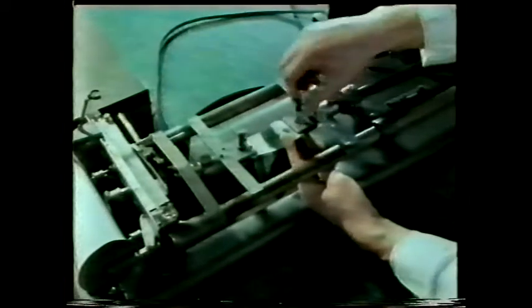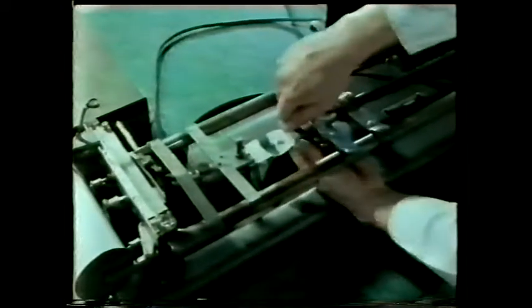Let's see what happens when we try pulling two similar pieces of fabric apart after the bond has had time to develop. We're doing this in a tensometer. Here we're peeling the two pieces apart. The fabric we've chosen is stronger than the dried adhesive - see how the adhesive is being stretched and torn? The bond is produced by the adhesive wrapping itself round the fibres of the fabric. The adhesive interlocks with the fibres, forming a mechanical key. This is called mechanical interlocking.